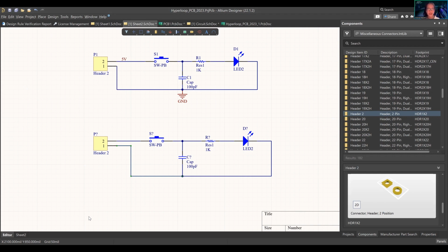Okay. So this is essentially the easiest way to think about it, because you have your battery and you have your light bulb, right? But it needs a ground connection to connect, and at the same time the signal's going back up this way. So there's a return path, and that's your ground. So you need a ground, basically. There needs to be a return path for every signal, whether for the actual signal itself, or a differential pair, which we'll maybe talk about in the next workshop.